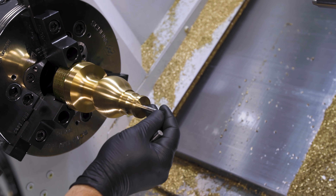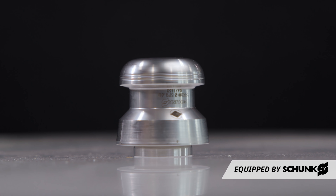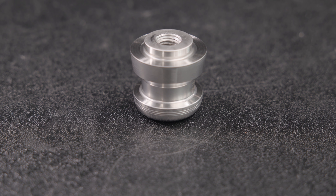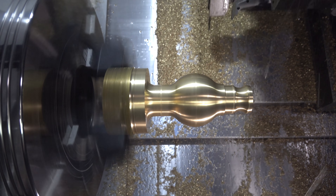Now that we've drilled our deep hole, we're going to go ahead and cut a counterbore in the top of this to fit one of our Vero S pegs or feet. We're going to make a counterbore to plus or minus a couple tenths for this to drop right down into nice and clean, and then we'll put a thread to match. First we're going to use a big inserted drill to open this thing up nice and quick.